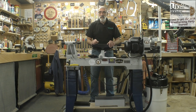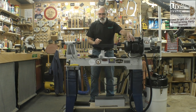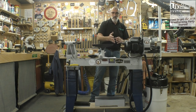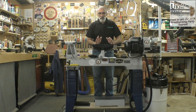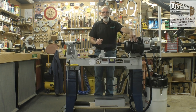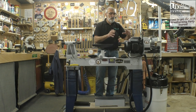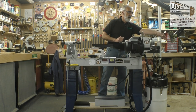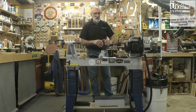The weight of the machine is a hefty 178 kilos, so it's a nice weighty machine for stability. I had a question regarding the motor fan sucking in dust from your turnings because on my other lathe it was facing that way. I've been assured that it's a completely sealed unit. Simon's been using both this and its larger brother the XL for many years without any problem whatsoever. The one advantage of having the motor facing this way is that it makes the whole lathe a bit more compact, and there's no problem with the motor facing this way.